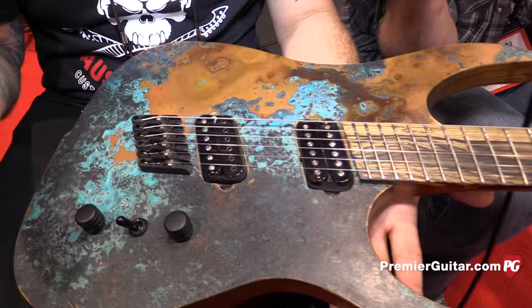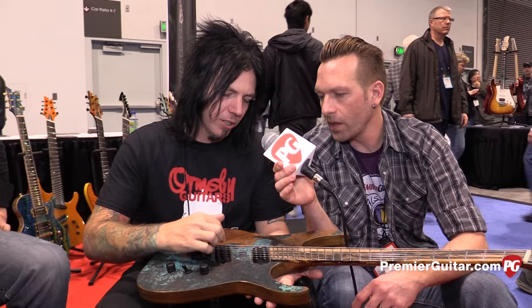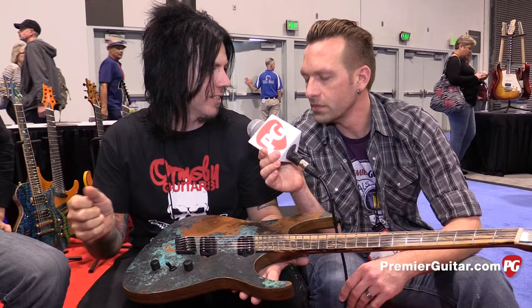No, they're not. This one is 9.3K, which wouldn't normally be associated with metal music. But what we do is we use an Alnico 8 magnet. That gives us a lot more oomph, if you like. It tightens up the signal a little bit. But it's also the pole pieces we use. So this side has the alloy pole pieces, which add a little bit of grit to the tone without adding that hot signal that goes to your amp. And that way we can let the amp do what it needs to do, and that's provide the gain. My theory is we don't want a guitar to provide a gainy signal. We want a decent signal that can then be amplified in any way we like. And that way you can still keep clarity and roll back the volume a little bit, and it really cleans up, even if your amp is really cranked, you know?